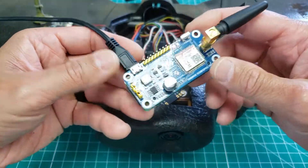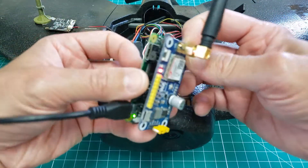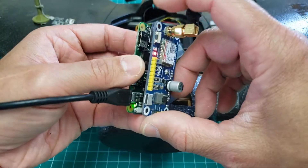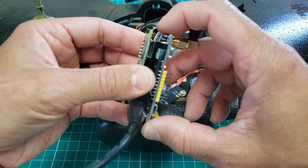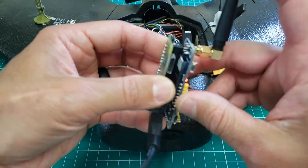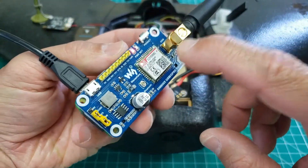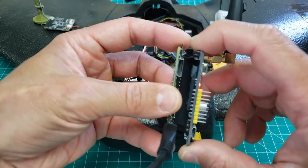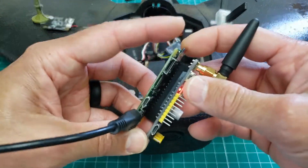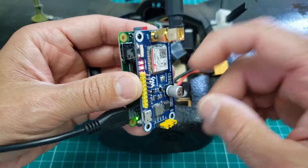For phase one, here's what I'm thinking: I'm going to be running DroneKit, getting GPS information, and trying to push that — whether via SMS or maybe to an HTTP endpoint. I don't think initially I'm going to wait around and try to get full Mavlink communication working. I just want to get this in the air and hopefully understand what's going on. It does already have a SIM — I purchased that from Hologram. I've been able to provision it and send AT commands, which is why I think full Mavlink communication could be a challenge, since the interface to this board is via AT commands. I've been able to successfully get GPS using the DroneKit API and send that information via SMS from this module to my phone.